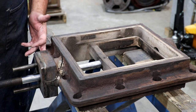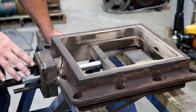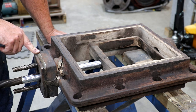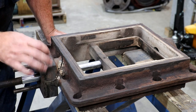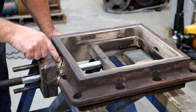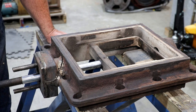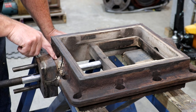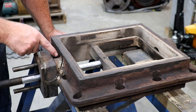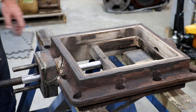Game plan: we're going to get in here and grind all this out, and then I'm going to braze it back together. We'll take a clamp and kind of bend it back - it has bent out a little bit. This has been repaired in the past and you can tell they used nickel rod. I'm not a fan of nickel rod on cast iron. What often happens when you're welding cast iron - when you're actually melting it - you melt the base material, you melt the cast iron, and you get a brittle line between the two areas that you're welding. That area with the cast iron becomes so brittle that it's very prone to breaking again. With brazing, we don't get the cast iron hot enough to change the physical structure of it, and you pretty much retain the strength of the base material. The nickel isn't really what broke - it was the cast iron that busted back out again. But we're going to get in here and braze it up and make a repair.